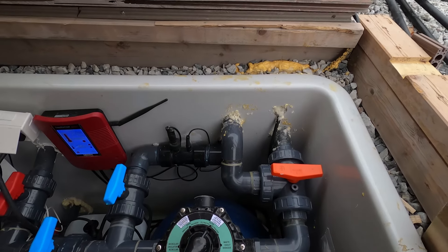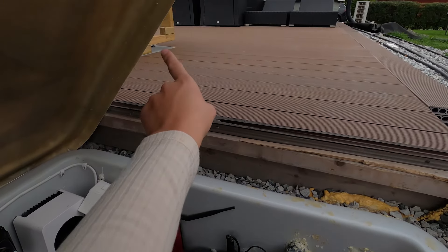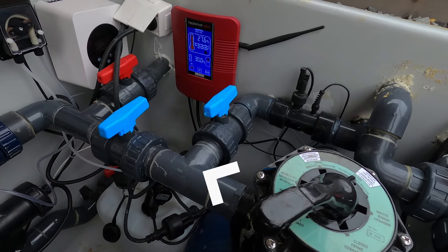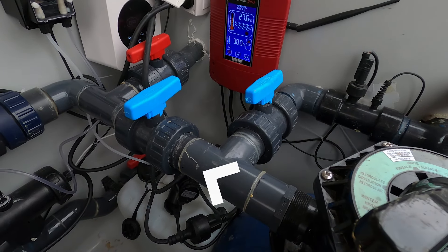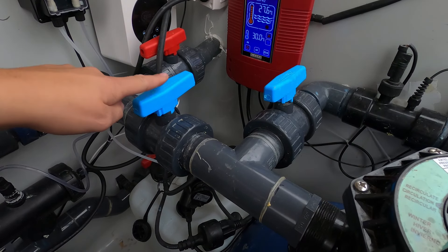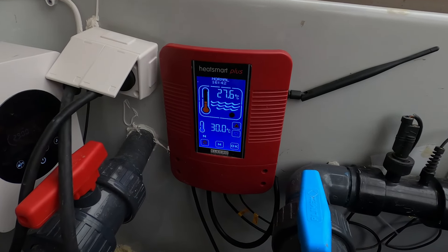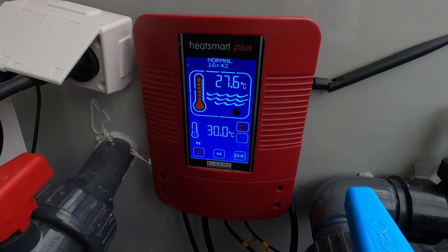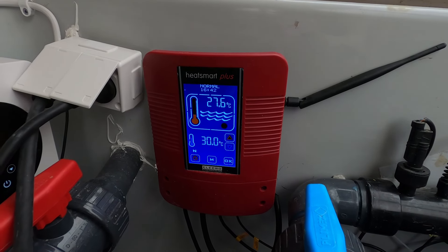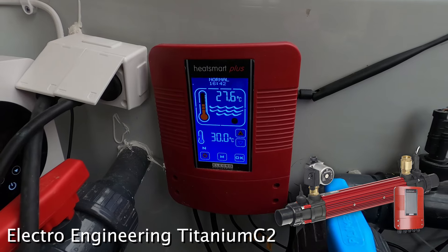Based on the valve selection, water will either proceed out of the drain port or back into the system. If waste or rinse mode is selected, water goes through the drain port to either lead out into a stormwater drain 30 meters away or into a spare flex pipe that can be extended. If recirculating or filtering mode is chosen, water continues to a bypass valve that lets us adjust the flow to any of the pipes or fully close some circuits to control the flow rate. The water then goes past a flow sensor for our Electro-Engineering HeatSmart+, responsible for turning on and off our air-to-water heat pump. The HeatSmart enables remote control for smart home systems and was also a requirement for our planned upgrade to the Electro-Engineering Titanium G2 heat exchanger, a way to utilize our existing geothermal heating system used for the house.